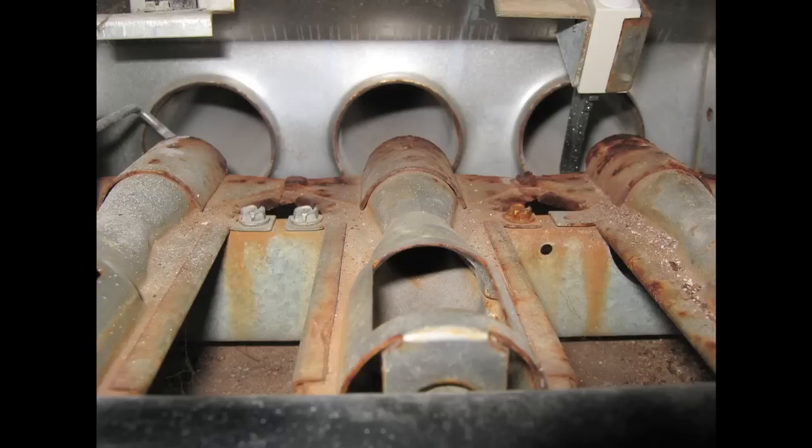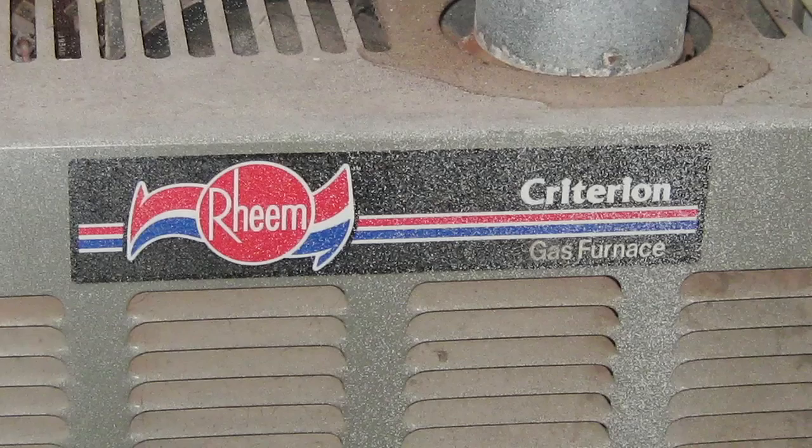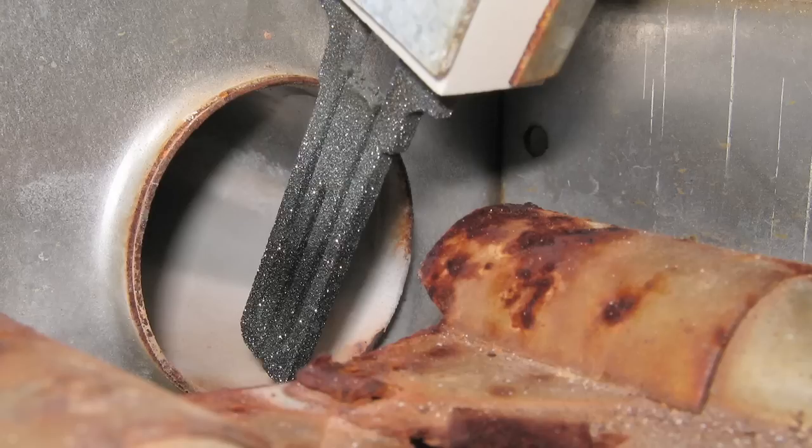I didn't know at this point what type of ignition this furnace used. I assumed it would be a spark igniter like those found on gas grills and most newer stoves. I expected a rapid clicking but I heard none. That wouldn't surprise me since I've known spark igniters to be prone to fail. However, after a little research I learned that this furnace uses something called a hot surface igniter — basically a glow plug that gets red hot and sets off the natural gas.